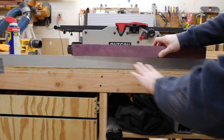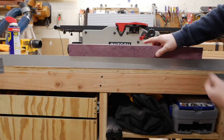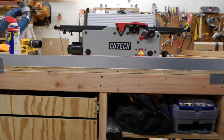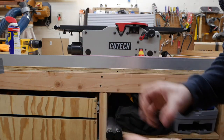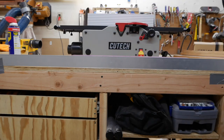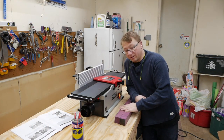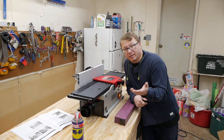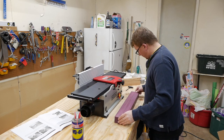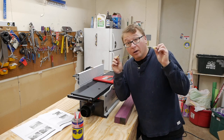This board is cupped since I cut it — this actually happened shortly after I cut it. This Purple Heart was kiln-drying and had a lot of stress in it. We're going to try to flatten it with the jointer — that's the whole point. This is the jointer; this is the Purple Heart I'm going to joint. It's going to be super loud, so I've got ear protection. Always, always use your ear protection.